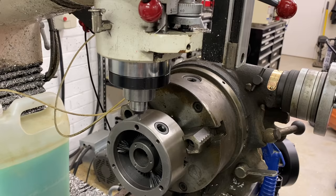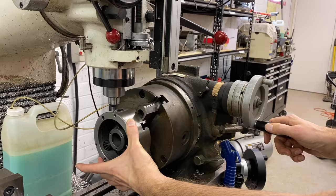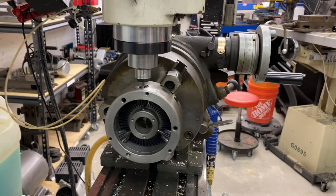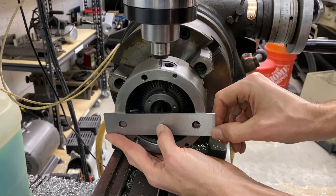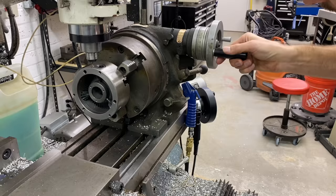The trickiest part is finding four positions on the diameter of this chuck that you can drill and tap without interfering with any of the other holes. You can do that visually, using things like a parallel to help. I'm going to try a couple of positions — these would clearly clear in Z for a cross hole pattern in Y. It's only got six holes in the back to deal with. I'll put a little mark on our intended orientation and rotate the chuck to where we want it, so we have easy angle numbers to work with. We're at X150 and centered on Y.